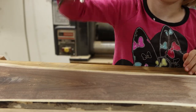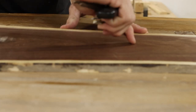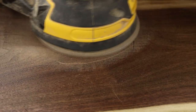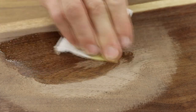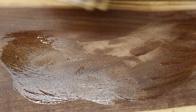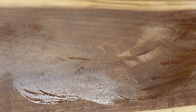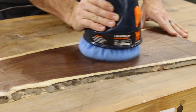I wanted to see how durable the finish was, and it was really easy to dig in and scratch both of these surfaces, but that was to be expected. This is the real beauty of both of these products — all you have to do is sand down the surface, clean off all of the sawdust, and then reapply your finish. If you do all of this properly, the flaws should completely disappear, and you don't even have to sand down your entire surface like you would with a film finish. I actually forgot to get all of the sawdust off before reapplying the finish, but it really wasn't that noticeable — though it only seemed to affect the Rubio Monocoat side. The General Finishes side was completely invisible.